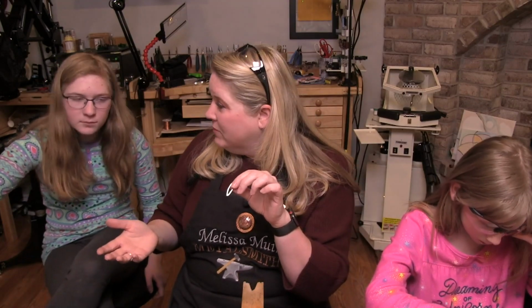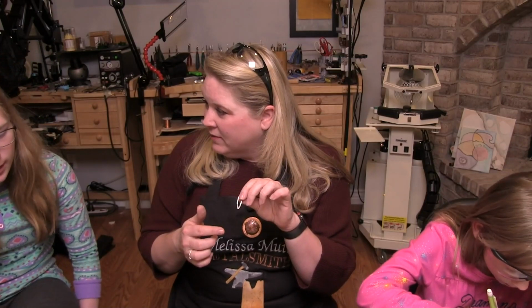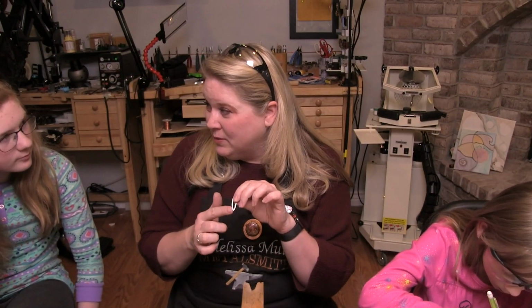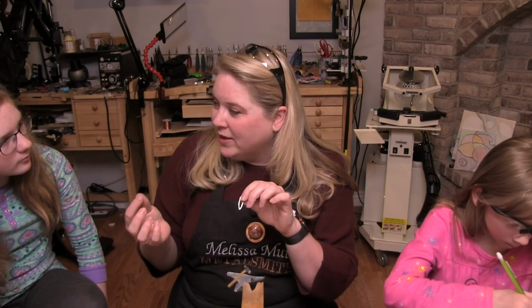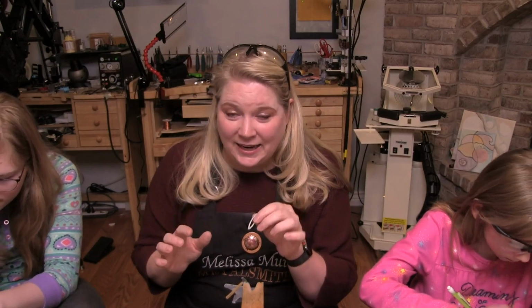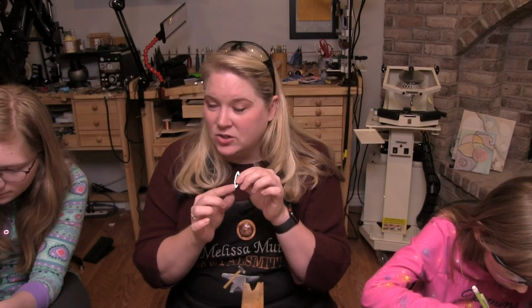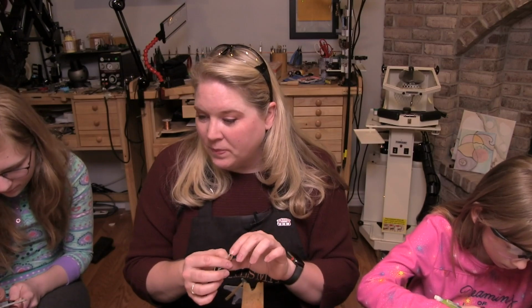Okay, and my stones are 1.75 millimeters. How wide was my wire? Do you remember? 2 millimeters. It was 2 millimeters. I don't have a lot of room here to move. Okay, I've got 0.15 millimeters. Do you realize how small that is? Let's find out. Yeah, it's like nothing. So I need to be really careful and make sure that I don't remove too much material there. So very good question.